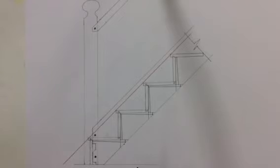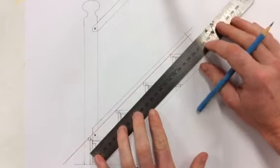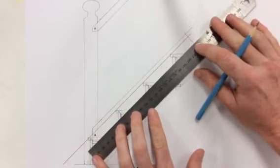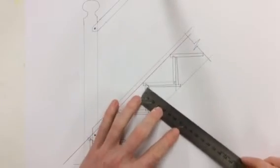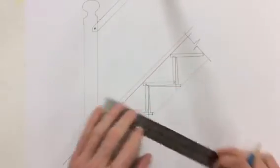Again, there's no real fixed size on the likes of those. You have your glue blocks then, which should be 50 by 50. It's not going to be a square, it's just going to be basically a 50 by 50 block cut in half. So your glue block, we could just put in something as simple as that. So from the corner, I'm going to measure out 5.